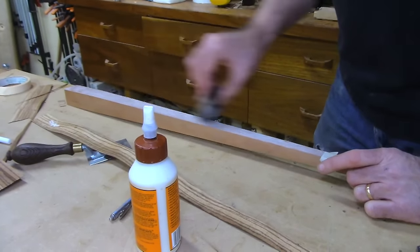You know how you sometimes have to put a square and square a line around a square leg, hoping it ends up in the same spot when you get to the other side? That's what we're doing now but with a knife line — there's no forgiveness here, we can't erase it, so I better get it right. I'm finishing with a little sawing into that to make sure I get through that piece of veneer. Then I'm going to work from that outside corner, flip the square and put my knife right in that knife line, bring the square up to it, and score right across. And then once more from the last direction — put the scalpel in the knife line again, bring up the square, and score across, hoping it hits the other knife line. And we're connecting nicely all around.